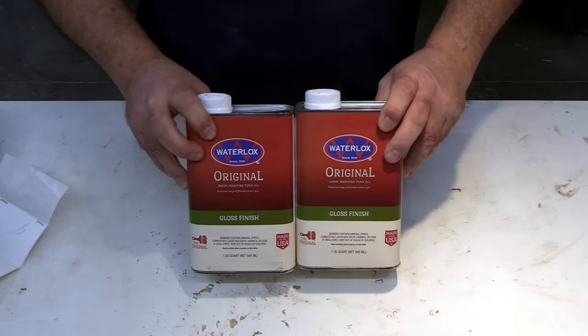We are all set up and ready to hollow out this dinosaur looking piece. This is the retrofit tool from Hunter Tool Systems. If you do any hollowing, I recommend getting this. We'll be able to see this well because we've got quite an open form here. And of course, there is a laser mounted above here if you haven't seen this before. Right now it's probably like an inch. So the idea is when that laser slips off the outside of the form, that means you've achieved the wall thickness that you have set.